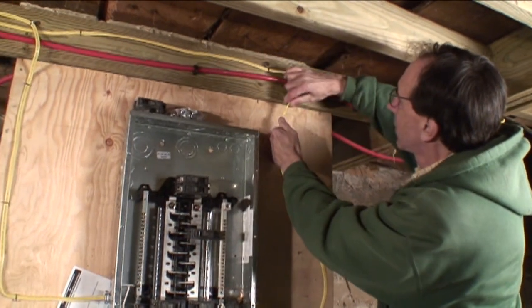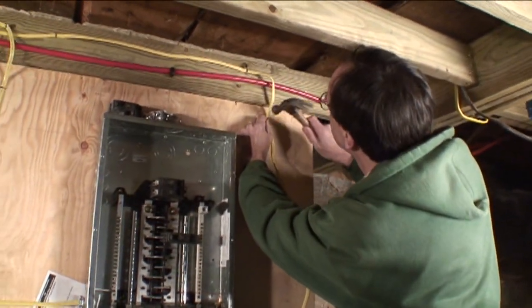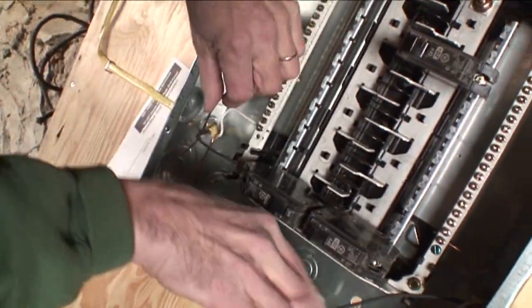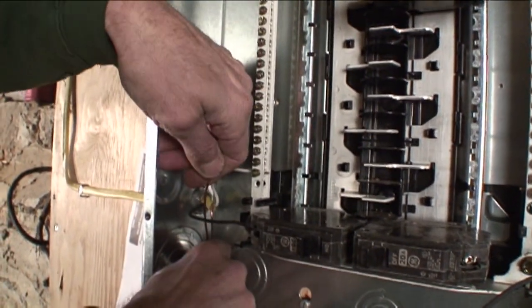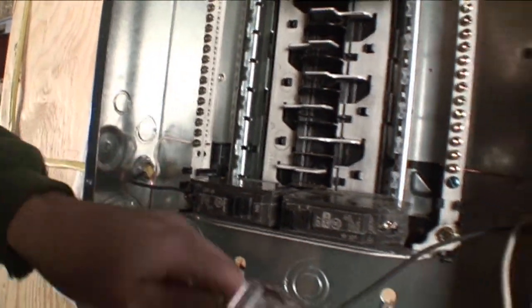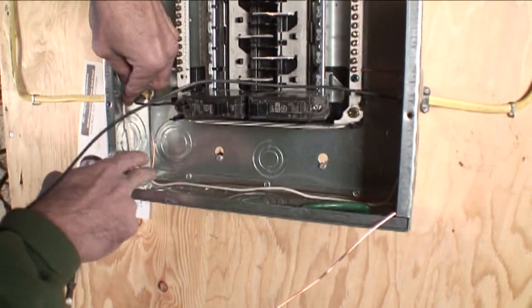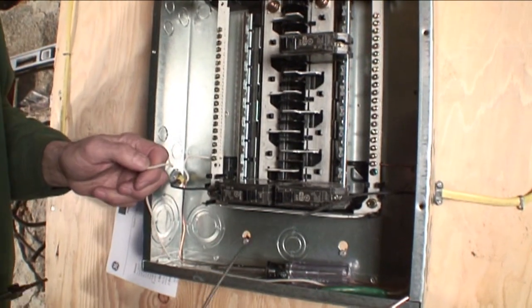By coming down like this, I buy myself the couple of inches I need to make sure we're okay. So I've set this over just a couple of inches, and that has bought me enough wire so I can do a neat job and bend it up. We're going to snake it around — again, this luxury of not worrying about shorting out anything and getting an electrocution live on TV is a good thing. The white lead — the neutral — goes over here, so let's get that over where it's supposed to be. Nice square. And now we're going to strip this wire back.